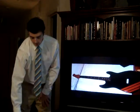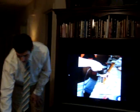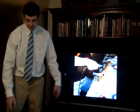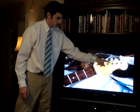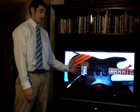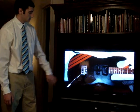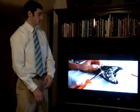After the final buffs of the body, I attached the neck by screwing in four bolts which go through the body into the neck to hold it in place. Then I attached the tuning pegs at the top of the headstock — the screws go in on the reverse side so that the front simply looks clean, and this is where the strings come through and attach for individual tuning. I also installed the bridge into the base of the body, and went with the tremolo bar, which connects to springs on the reverse side of the guitar.